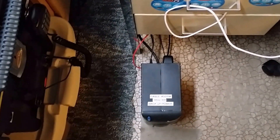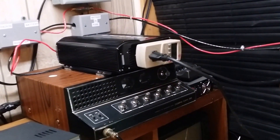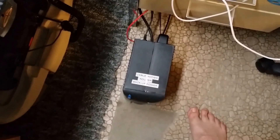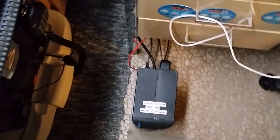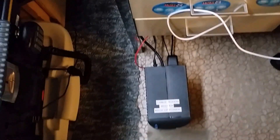The inverter is powering the UPS and then we're breaking it back down into 12 volts to charge its two batteries. So in a sense I'm still charging the two batteries in the garage, but the problem is I'm probably wasting a good deal of energy by going from 110 volts down into the UPS, the UPS back to 12 volts, and 12 volts out to charge the other batteries. I haven't found a better way to do that right now — hopefully I didn't confuse anybody out there.